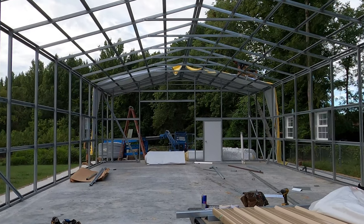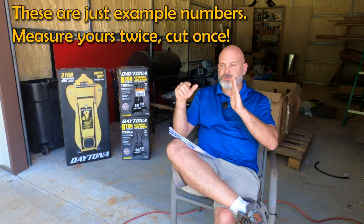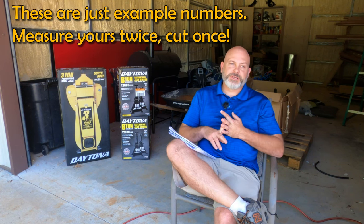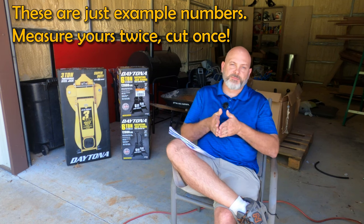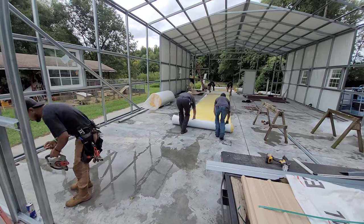With the building all taped up, now we need to figure out how much insulation we need. The insulation should drape over the building and drop down to the ground on either side, sticking to the tape. Measure all the way around: for example, 10 feet per wall and 14 feet per roof section gives you 48 feet total. Roll out about 50 feet, cut that off, find your center mark and mark the tab. Then roll both ends of the insulation so the two halves meet at the center mark.